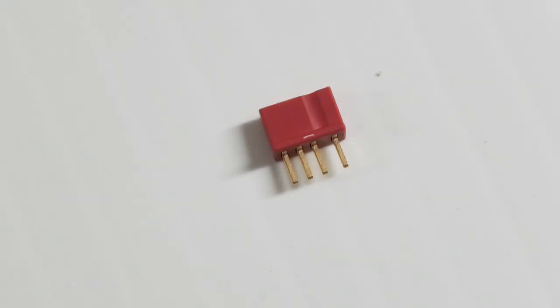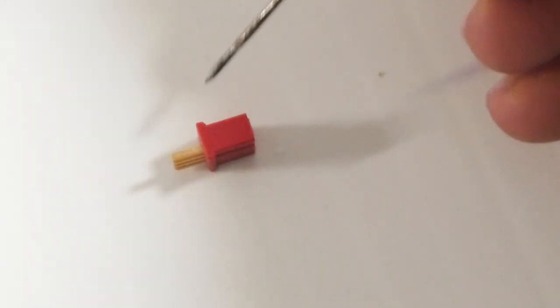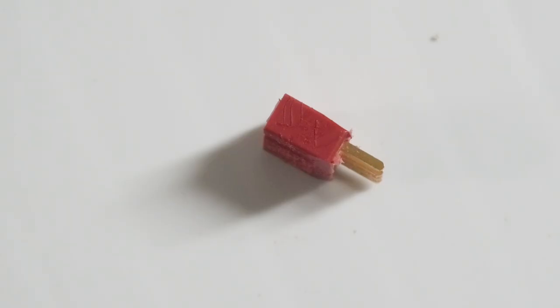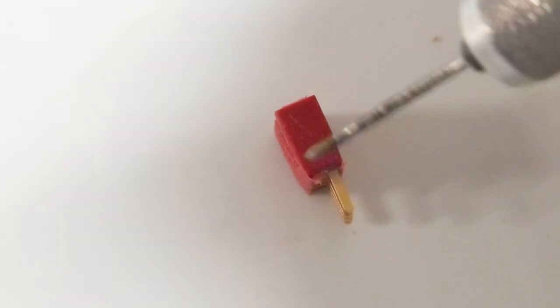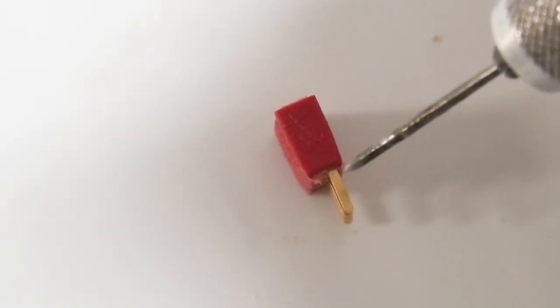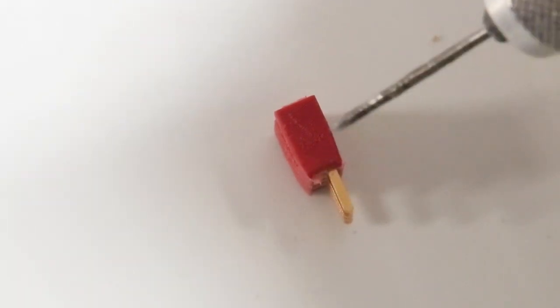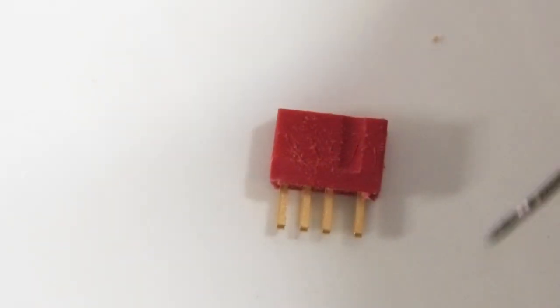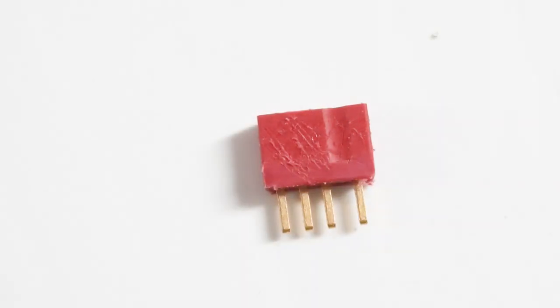And before we glue these into the tip panels, we're going to do some work to make sure everything fits together properly. So, first thing we're going to do is take this guy and grind off these steps on both sides. So I'm just going to use a Dremel with a sanding drum. Okay, so I went ahead and ground down those steps, and I actually put a taper on the back side of this connector, and you'll see why I did that in a minute. So when you grind down that step, go ahead and file an angle on both sides, and then I also scuff this up with some sandpaper and the tip of an X-Acto knife so that you get good adhesion to the epoxy when we epoxy it in.